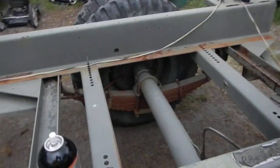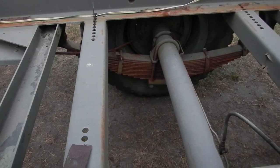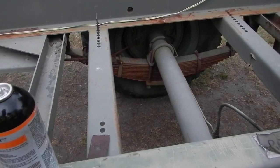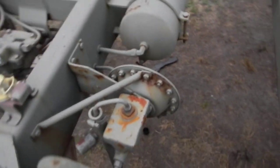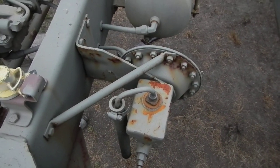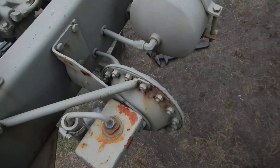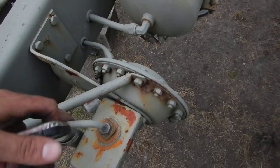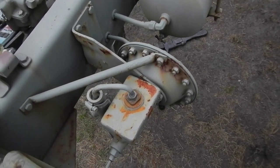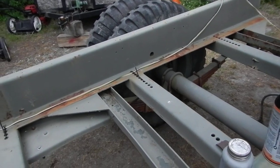It has hydraulic drum brakes. The hydraulics put pressure to the cylinders and the drums, spreading out the pads, and that is what stops this trailer. It has a master cylinder just like any vehicle you would drive — this is your master cylinder right here. This is your brake air chamber, and this air chamber converts the air into mechanical energy which goes into the hydraulics, putting pressure onto the drums inside here.